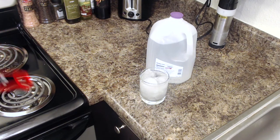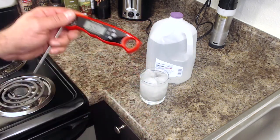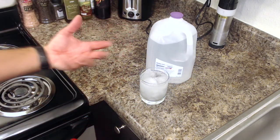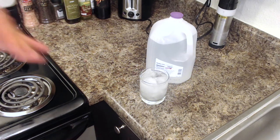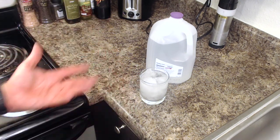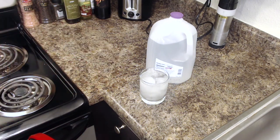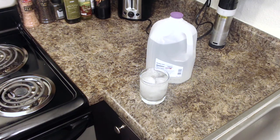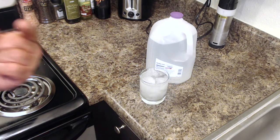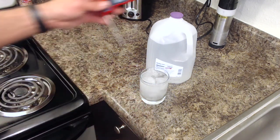The first thing we're going to do is use some ice water made from distilled water. It's important to use distilled water because any minerals added to the water will reduce the actual freezing point, so we wouldn't have the intrinsic standard we're looking for. I've made kind of a slurry here - the ice cubes were a little too big so I ran them through my food processor to get them a bit finer. In the future I'll probably get some gumdrop-sized ice cube trays that are ideal for this, but we should be pretty close as it is.